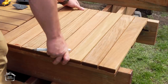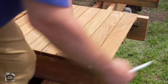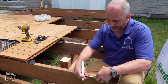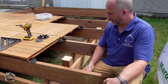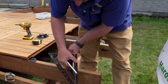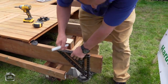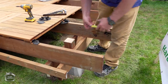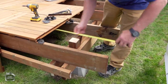I'm marking where my tile finishes - that's the edge of my deck. I want to take off an inch and a half from my ridge. I'll take my square, mark my line, bring my saw over, and cut this in advance. Now I can take my finished edge from the plastic trim. I'm going to be cutting at 22 and a quarter for the whole way across.